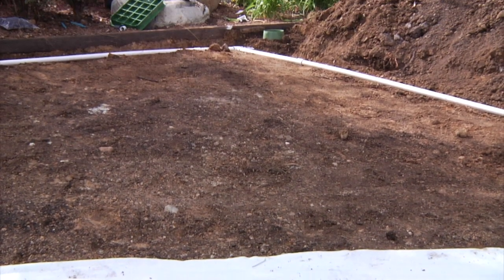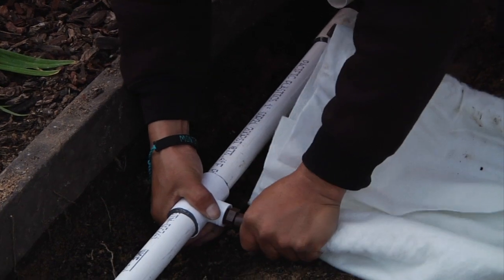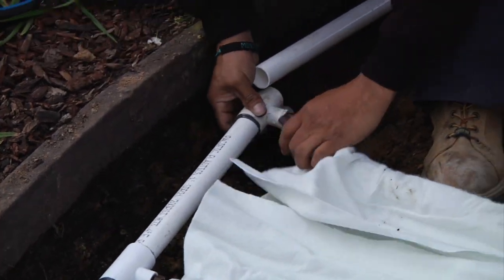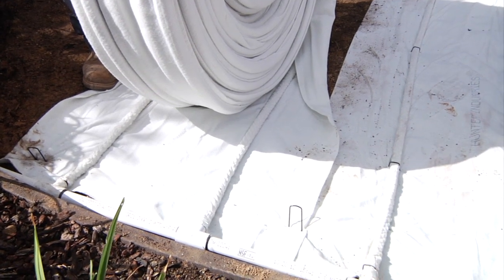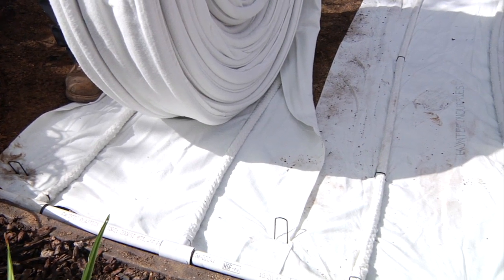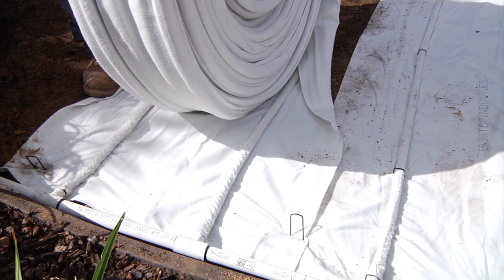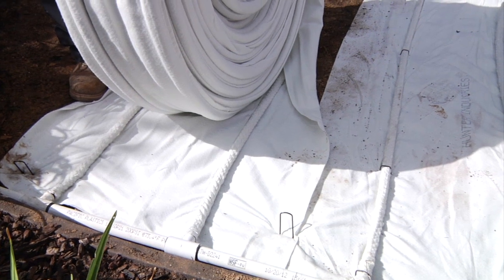At the highest point of the installation, we'll be installing the air relief valve, which is installed on a half-inch riser inside of a six-inch round green valve box. We use the valve box in case we need to access the valve in the future. The air relief valve is always installed at the highest point on the installation. We have our first section of Ecomat connected to the supply header, which has been sized appropriately for the amount of Ecomat being installed. We've already connected our second roll of Ecomat into the supply header, overlapped the two fleeces by about three inches, and will begin to roll out our second run.